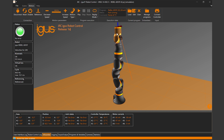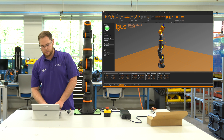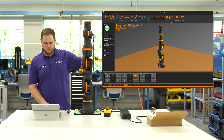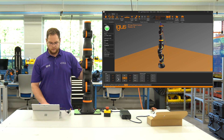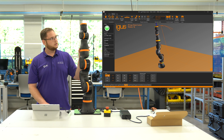I'll hover over the fifth axis in the software to test if the robot moves as the software behaves. I'm hovering over the joint, it gets marked, pressing the left mouse button and dragging it down. You can also go to jogging and use those buttons if you prefer. I want to start with the smallest joint that can't really harm me. I'll use my hand on top of it — it rotates as well. Joint four works too, and visually the simulation matches the real one. Joints three, two, and one all function correctly. Now we know all joints are running.